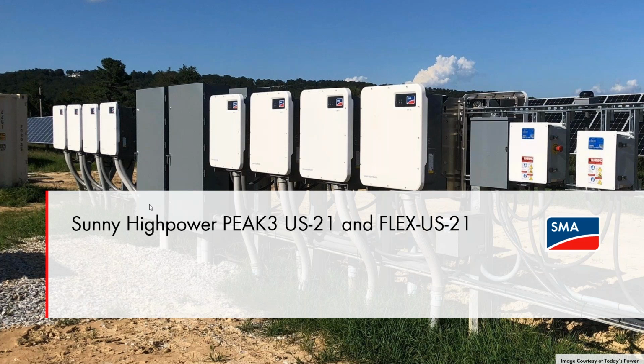As we said, that is a recommended clearance. The reason we do that, if you've worked with the Core 1, is that 3 sides of the Core 1 have potentially user swappable boards behind them. So for areas of very high ambient temperature, we want the clearance for just good airflow, but primarily we're asking for that as a recommendation for ease of access to the inverter for servicing. For the PEAK3, all access is going to be straight from the front. So that's why there's less recommended clearances around the sides and in essence the back for that product.